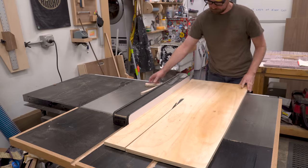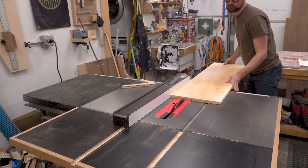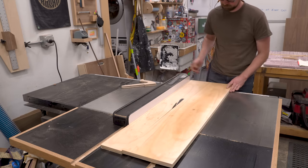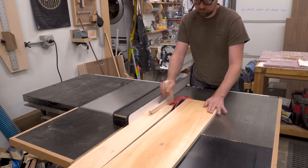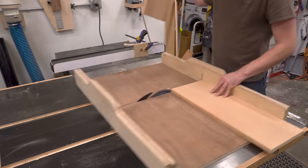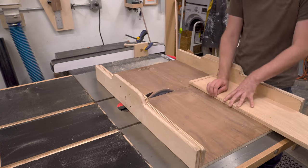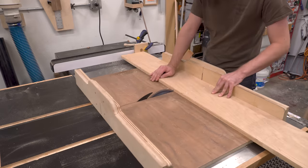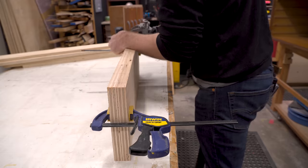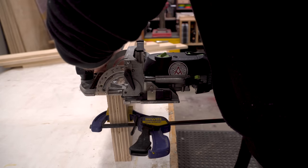The original flat file is not tall enough to put the Glowforge at working height if it's set on the floor, so I decided to build a plywood box underneath it to get it up to that height. The cool thing about this is it actually allows me to add more drawers to this cabinet and some deeper drawers so I can store some of the Glowforge parts that it comes with and some other odds and ends. To assemble the box, I went with dominoes. You could just as easily go with pocket holes, but the domino joiner is super fast.